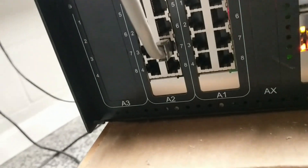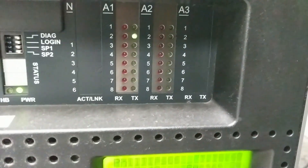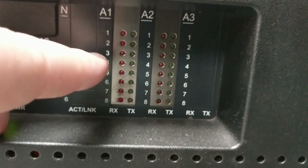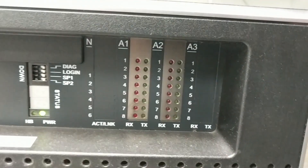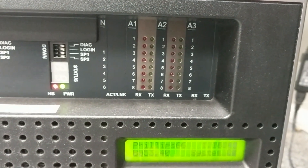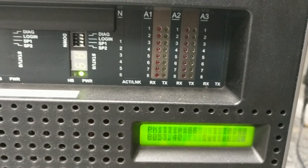One other thing to note: with A27 plugged in, if you go to the front and look at the corresponding lights, when there's activity on A27 you'll see that light momentarily. We do have something showing on A12, which is a little confusing since we don't have anything plugged in — I think that's because the fuel connections are assigned to it, but since this is the test bed we don't have any fuel dispensers connected, so it's trying to reach out but there's nothing there.